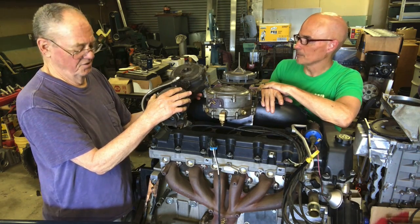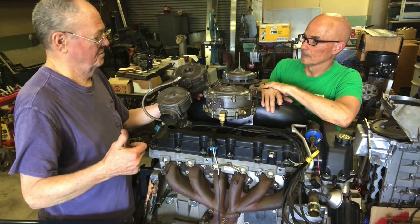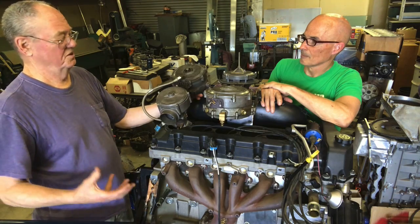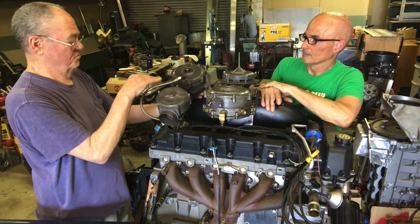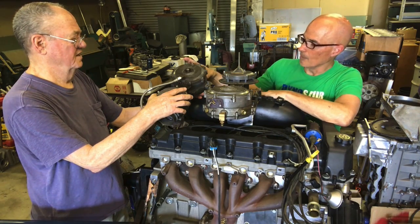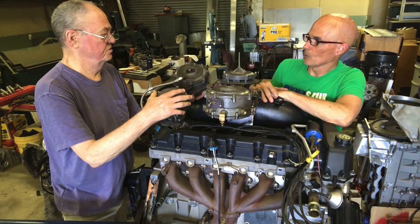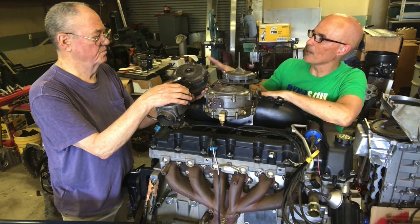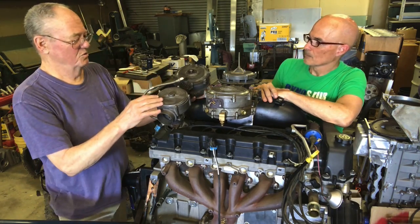It's actually a good refrigerant. Whatever the vapor pressure in the tank is, it's proportional to the temperature — if you raise the temperature, the pressure goes up, and if you lower the pressure, the temperature goes down. So the tank will get cold if you take the gas out and it boils; the liquid will boil and absorb heat. The same thing happens here in the converter, so you have to provide heat. We're feeding liquid propane from the tank into this, and we're also adding hot water from our cooling system to heat it up — that's called the heat of vaporization. You have to provide that or it'll all get very cold and stop. Temperature and pressure both change together; you change one, you've got to change the other.